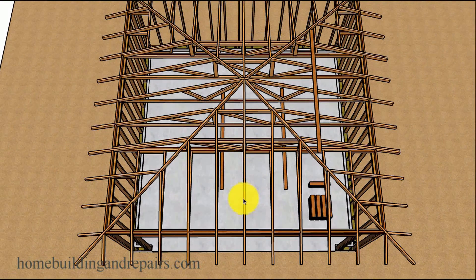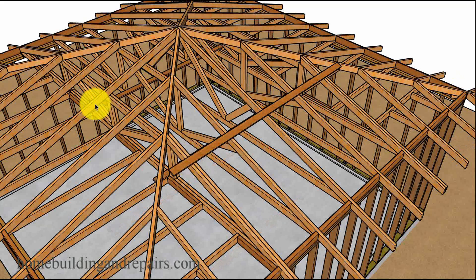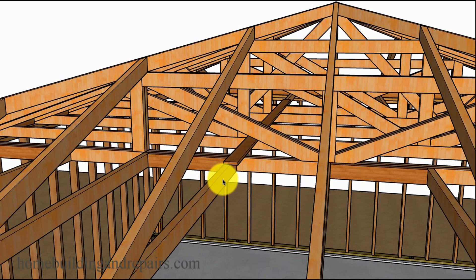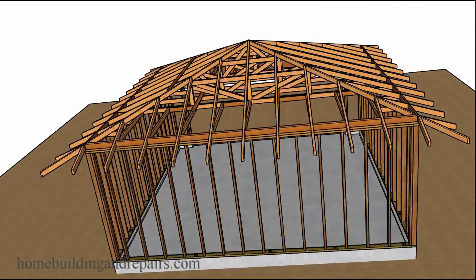Do the same thing to the other side. Here is your brace — once everything is ready, it can come off. The next step is to install a board that keeps the trusses lined up. In a situation like this, make sure it connects to a truss on the other side to create a solid tie across. It's optional but provides extra insurance. You can see how it now goes all the way across to the other side.